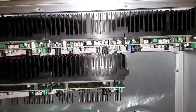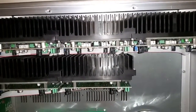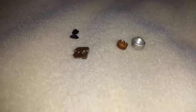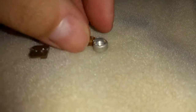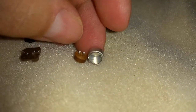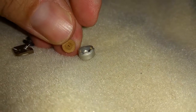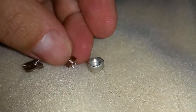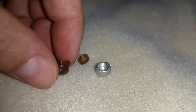And if you got a distortion noise during playback, you're gonna replace all of those. Let's take a look at a cap that I took apart and is completely dried out. There's nothing left to it. It doesn't even smell like ammonia or alcohol or anything anymore, so it can't do its job.